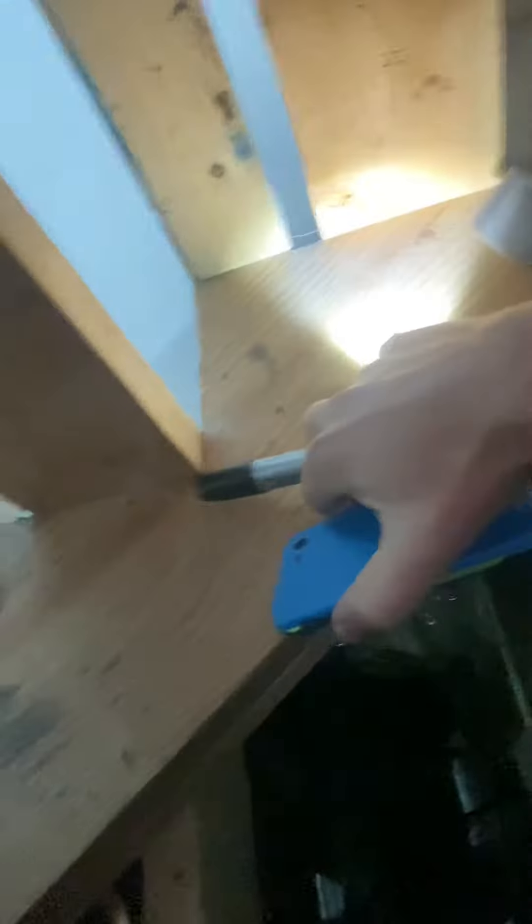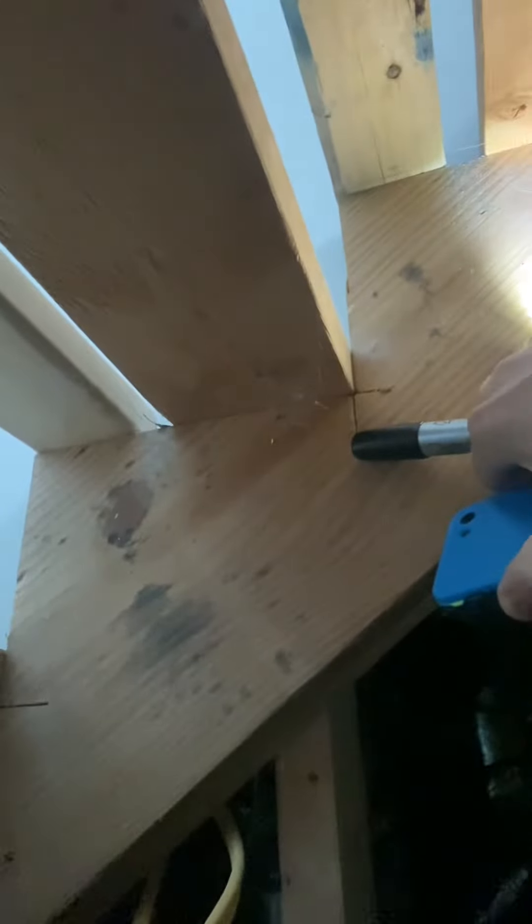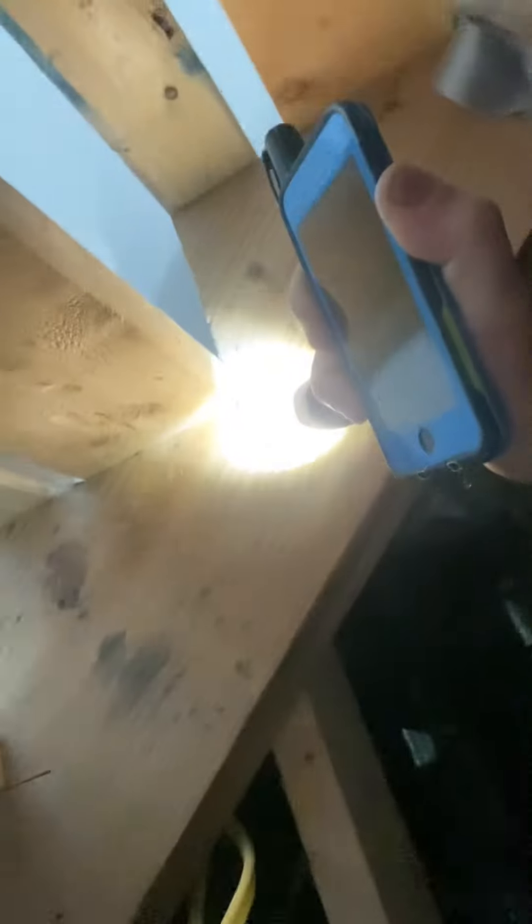You see where now, instead of having a six-inch piece of lumber, you really got to measure from here — so you're only dealing with probably a four-inch piece of lumber that's actually structural. Just be mindful when you're cutting stair stringers that they don't overcut these stair stringers.